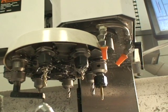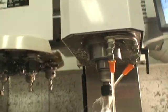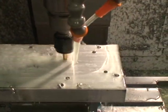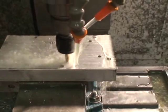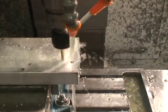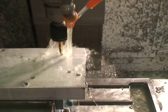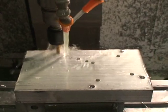This is the tap. It's a floating tap holder — it's got a little compression. Since this isn't rigid tapping, but it does very good; you can hold a very accurate depth. We're tapping here at 500 RPM — that really taps it nice. You can put a plug gauge in there, a go/no-go gauge. I use a bolt — yeah, that's all you're really concerned about.